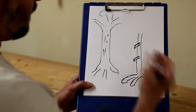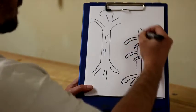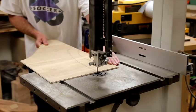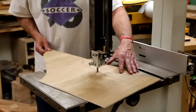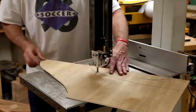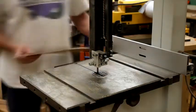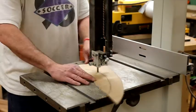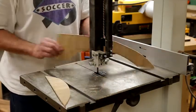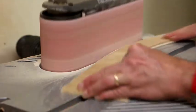I'm just trying to get a general concept here, and then I'm going to move on to creating patterns from which I'm going to make the final product. Here I am cutting out some of the beginning patterns, roughing them on the bandsaw, and then getting them real nice and smooth and fair. They're going to be pattern routed, so any mistakes in the surfaces are going to be translated to the final product, so it's important to take your time at this stage. There's one of the foot assemblies — here I am getting it nice and smooth on the sander.